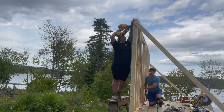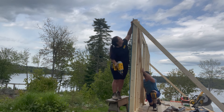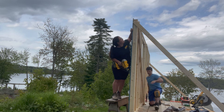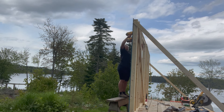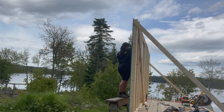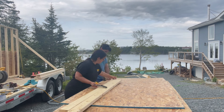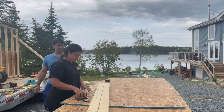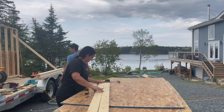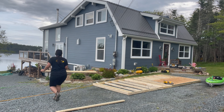My brother is prying off the base plate so that the second row of OSB can reach a full 90 degrees in the corner, and that's what I'm tacking in place. If you're doing this while it's standing up it's definitely a two-person job. The first wall is set with all the OSB on, so now we're moving to the second wall. I'm laying out the top and bottom plates at 16 inches on center — remember, this is extremely important in framing anything. I'll put it all together on the ground, add the plywood, and then hike it up on the trailer.